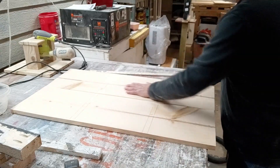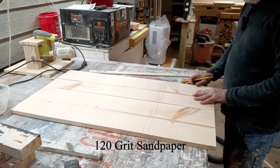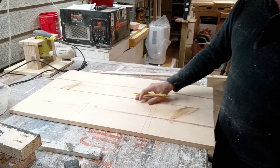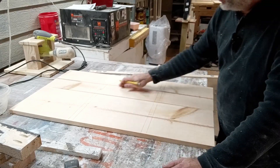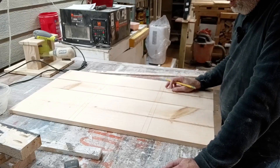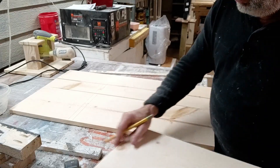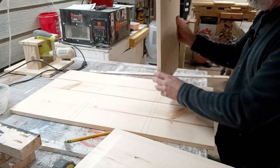I've sanded all these down with 120 grit sandpaper. I ran the shelves through the planer a little bit — they were just a little bit bowed, not much, but just a little. Running them through the planer takes that bow out and cuts the hump off. So I did that, sanded them, and now I've got the shelves cut. They're sanded and cut as well.